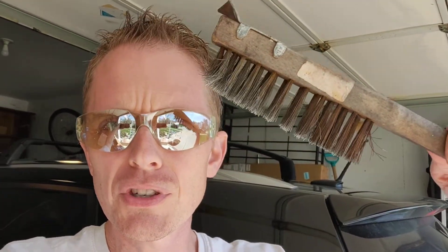You should have a brush — this isn't really personal protective equipment, but you're going to need a metal brush and a nylon push broom. Hydrochloric acid will eat metal, so you want to rinse these metal bristles off really well. Back to PPE: we have a multi-gas, multi-vapor cartridge on this P100 respirator. This is important because if you just use something that filters out dust or particulate, hydrochloric acid fumes will go straight through and still affect your nose, lungs, bronchioles, and mouth. So make sure it's multi-gas.